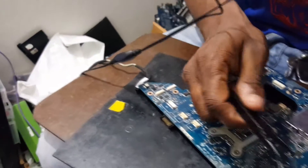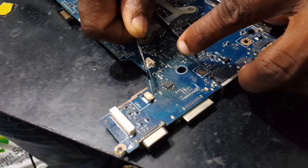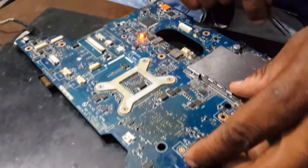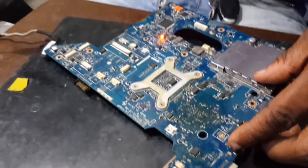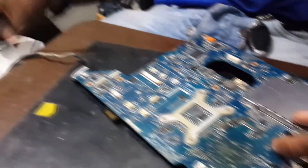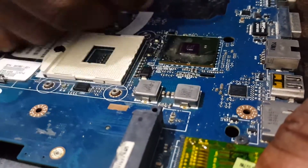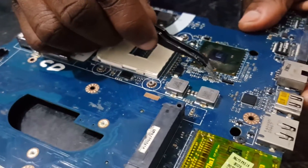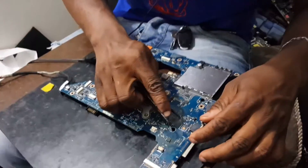This is the ground pin and we should show pin number 2 — this is the trigger. As we touch pin number 2 the light is on. Light is on — core trigger. So we are going to check the trigger fault. If any fault in the VCCRTC section — from here to here — no trigger fault will come. So we will disconnect this resistor R66, since it's closer to the PCH. We are going to trigger the board on pin number 2.